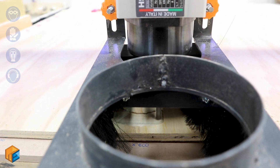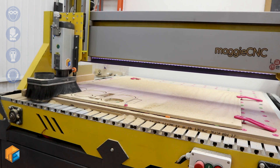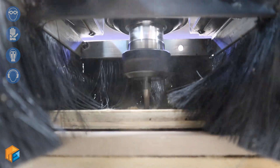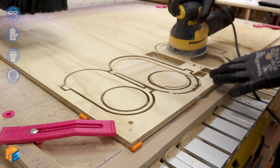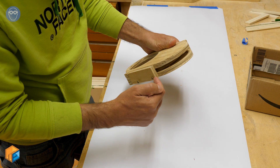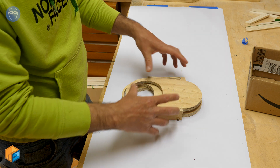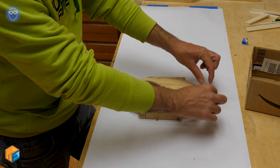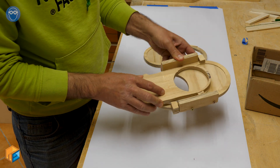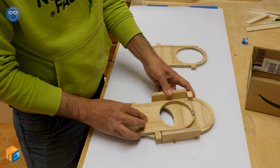This is the first design, which is a pretty classic design. I drew it on Fusion 360, then carved it on the CNC. I used 12-millimeter pine plywood — pine plywood is a very cheap material, it's pretty raw, so I sanded it. The shape is pretty much the same blast gate we all know; the only difference is I didn't put a trim inside but used a rectangle to separate the two flanges, and I rounded the borders because those angles are not needed. You can open the gate and close it — but that's exactly the issue: it's too tight and does not slide easily, so I needed to leave some additional millimeters of clearance.